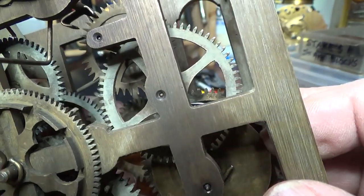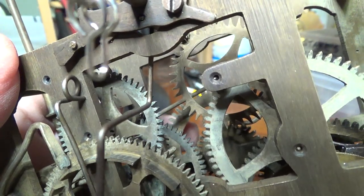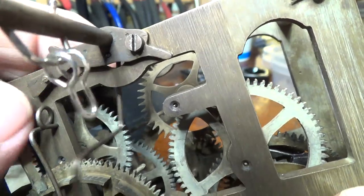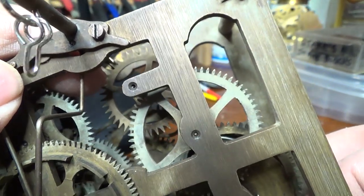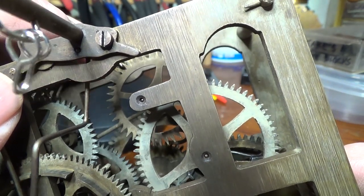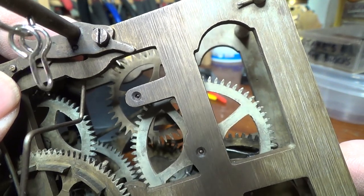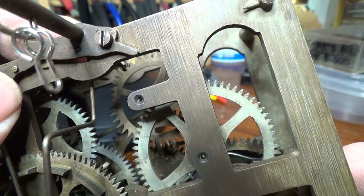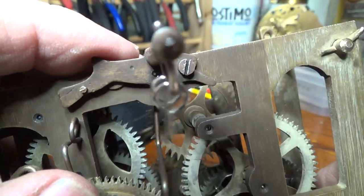That's one of the worst, and this is a perfect example of what tunneling is. If you look at the hole from the outside, the hole looks like it's perfectly round — that's because the pivot doesn't extend beyond the plate or even beyond the pivot hole. So it's worn on the inside and formed like a groove, kind of made like a tunnel in there. Those need to be replaced.